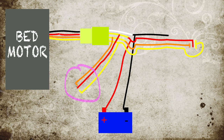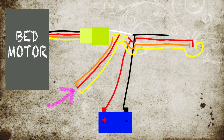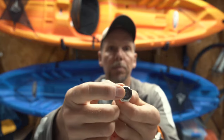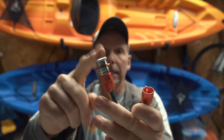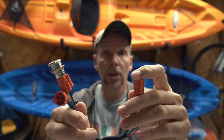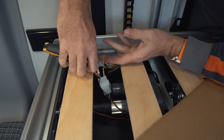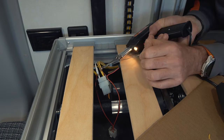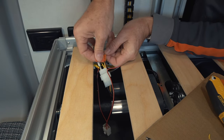Down here I have the same situation: I just need another toggle switch that connects the red wire to either the orange or yellow one. This new switch sits in parallel with the existing one and has the exact same function. I'm using three push-button switches — one main switch, one for up, one for down. The main switch must be turned on first as a safety measure, so accidentally pressing up or down does nothing unless the main is on. I'm splicing into the wires by carefully removing the insulation without cutting the copper conductor, wrapping my new wires around it, soldering, and protecting it with insulation tape.